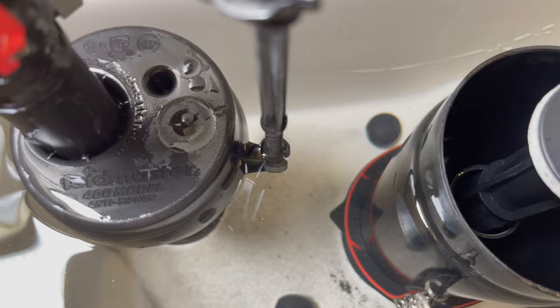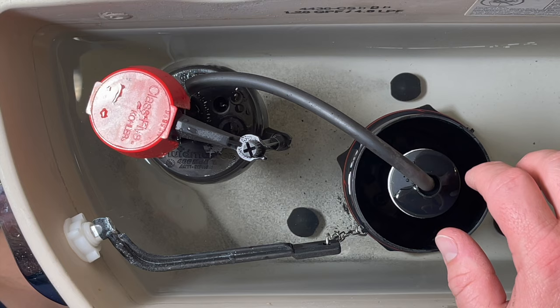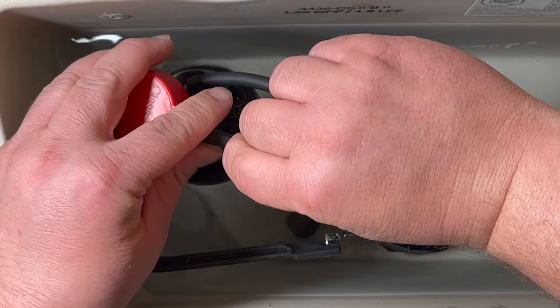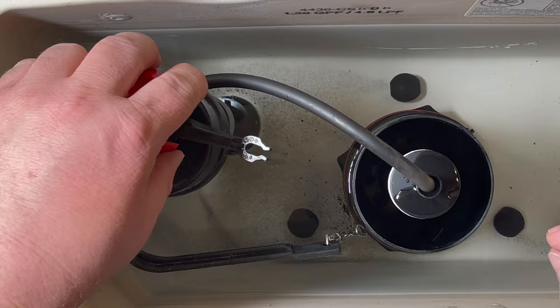This is leakage. My first thought was that it must be the seal down at the bottom of the canister, but that's not the case. I lifted up the tank lid and this is what I've got. The first thing I'm going to do is turn off the water supply down underneath the toilet. I've got that off. I'm going to go ahead and remove this floater governor here — it just pops out like that. Put that off to the side.